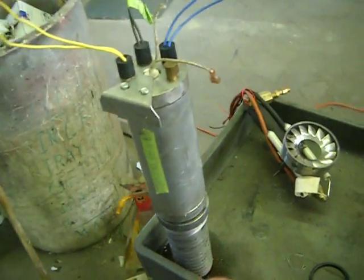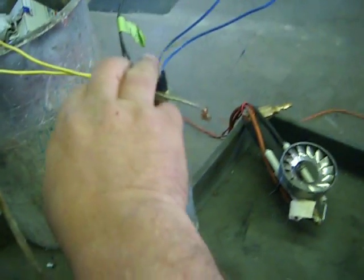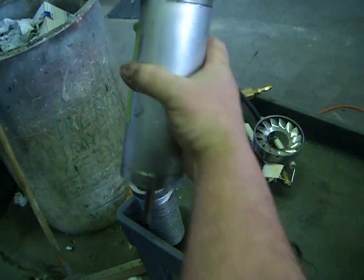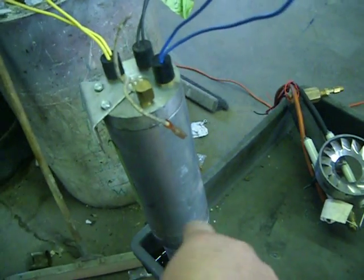Next, we're going to show you the five preheater switches. Three of them are on the preheater barrel. That's the oil preheater. It heats the oil up that comes to the burner cold. Has a heater element inside of it, down inside here, comes way down inside there.